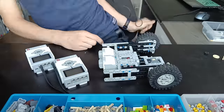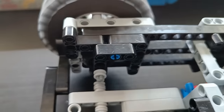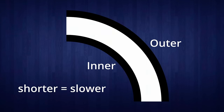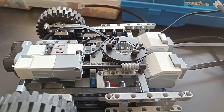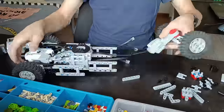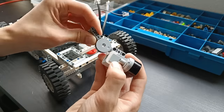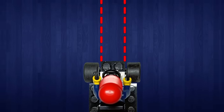My goal was to make this mechanism as strong as possible so that it would never break, and I think I did a really good job. It is incredibly strong but still pretty fast. It contains a differential, which will make sure the car can take corners, since the inner wheel turns slower than the outer wheel when turning. I added the ultrasonic sensor and the gyroscope, and also a motor for rotating the arm. After figuring out the steering system, I settled on connecting the motor directly to the moving lift arm. Above the wheels are the infrared sensors, connected using joints so they can be on an angle — able to see objects not only in front of the machine but also slightly to the side.